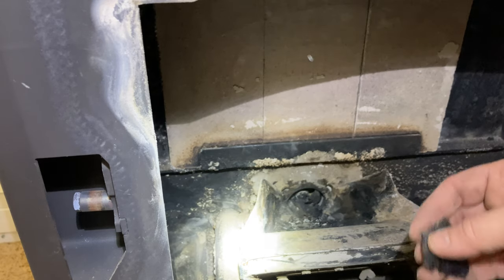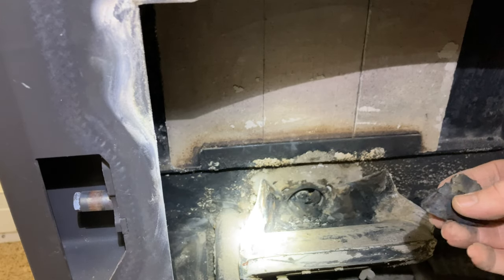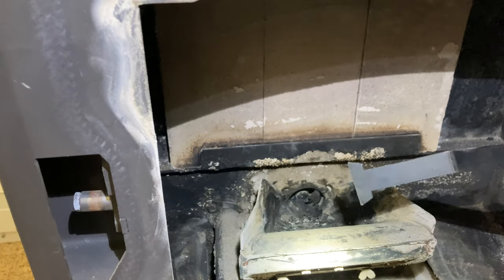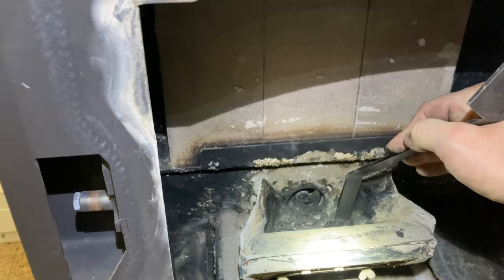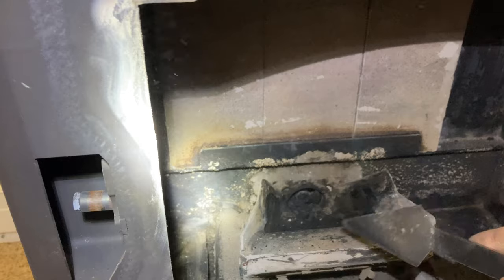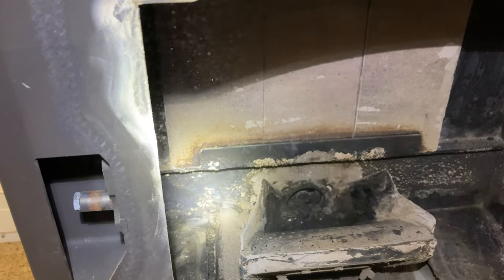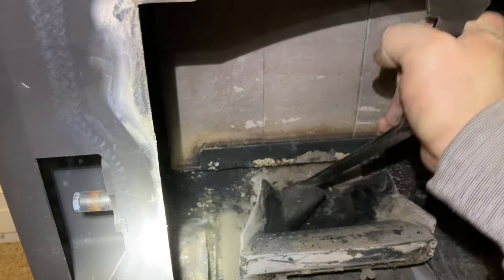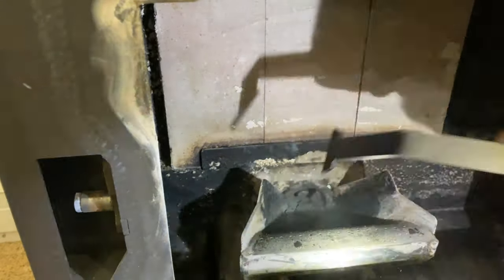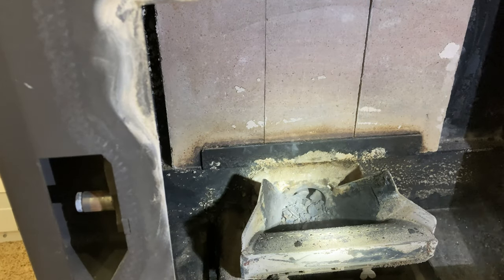Here's an example of how big some of those chunks are — solid and hard, and it's hard to get off the sides and bottom. But if you use the tool that came with the pellet stove, those will scrape off. The flat side of the tool gives you a more clean scrape. I use the pointy edge to break up things I can't scrape, and then the flat side to clean things down nicely. Then I use the shop vac and you'll hear those big chunks getting pulled out.